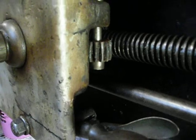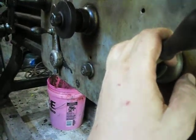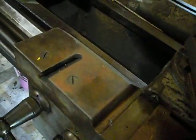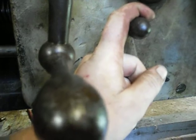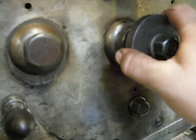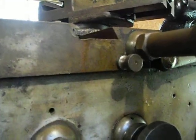I did already have this whole saddle apart and had to do some work on the inside of it because someone before me must have crashed it — you could no longer use it to move the saddle forward and back. I got that working good. This lever here — a lot of people on the internet are always asking what it's for — this lever is to adjust the backlash in your rack and pinion. Over time the gears wear out, and this is to adjust that so it has a nice feel. This is a clutch mechanism — you screw it in and it provides power to your saddle.